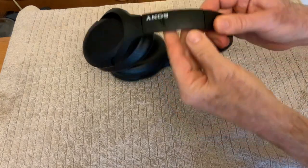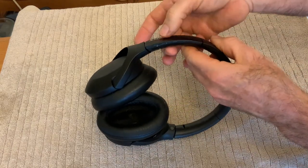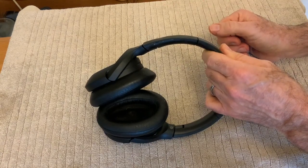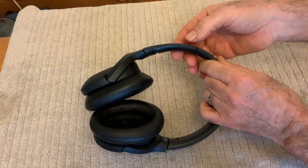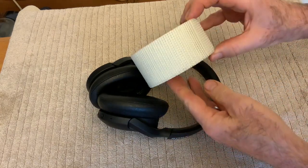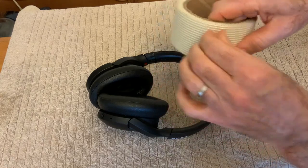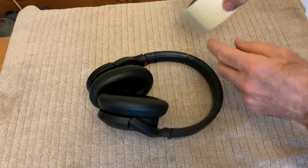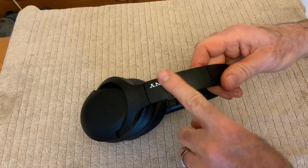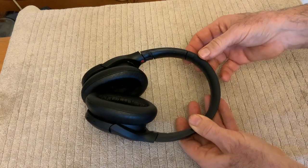So there it is dried. This has pulled the two pieces together and glued them in, kind of making them one piece of plastic. That might be good enough just like that, but because I'm a worrier, I'm going to make this even stronger by wrapping it with some drywall seam tape, which is fiberglass and super strong. I'm going to wrap it around there and super glue it on. First thing I'm going to do is wash this real good, clean it, and then give it a sand so the super glue can stick better.